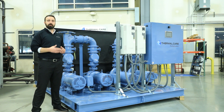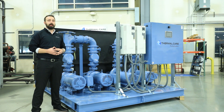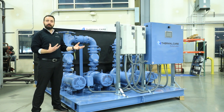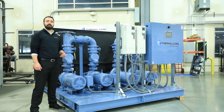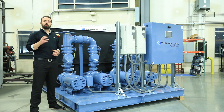The full divider is a true physical barrier between the two wells. That way, you can separate two different liquids — say, a glycol water mixture from pure water, or even a dirty loop from a clean loop like you might see with an open cooling tower system. Next, we're going to talk about the standard trim package on these units. I really feel that what we include here demonstrates Thermal Care's real-world knowledge and experience to actually provide some value-add to our customers.